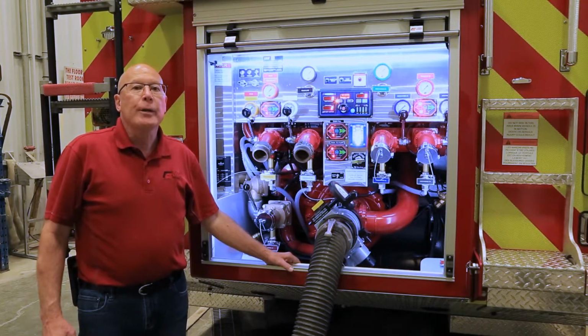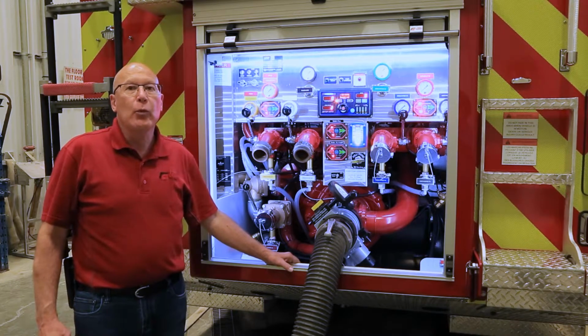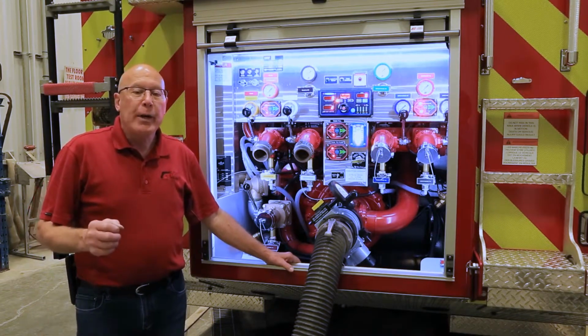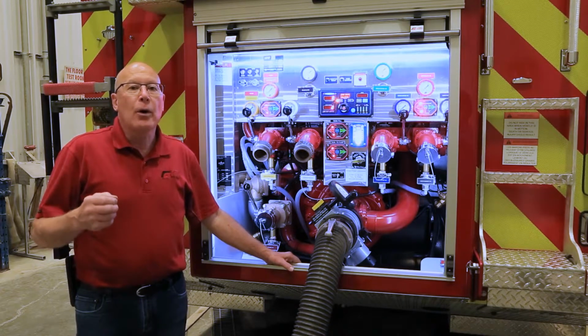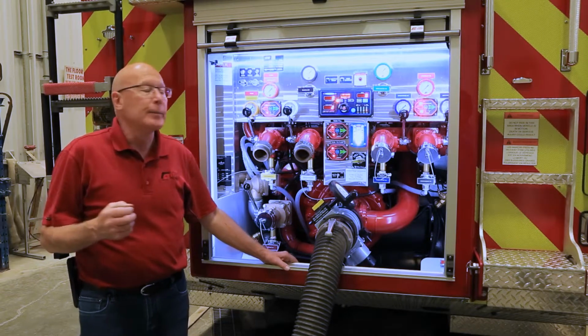In operation, the high pressure pump and the standard pressure pump both operate at the same time. We have incorporated unique features into the plumbing to ensure that both pumps are always wet, and both pumps are always circulating water back and forth to prevent any overheat.